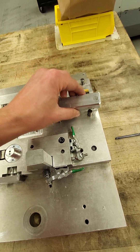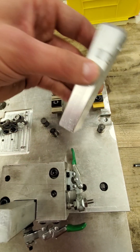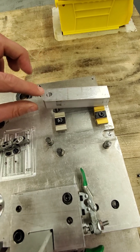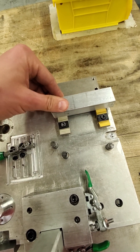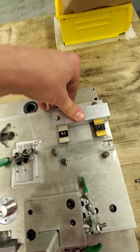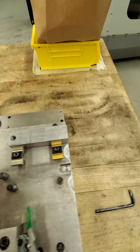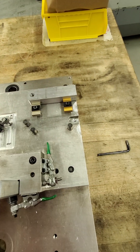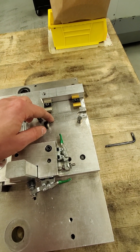You can see that this side in position one has a chamfer on it but no chamfer on this side. We're going to flip this component and put this hole onto this top pin right here, and just push it down so that this surface is flat with the fixture. If you see any chips or anything like that just clear them out of the way so that they don't get underneath the part. I have now moved position two to position three and position one to position two.